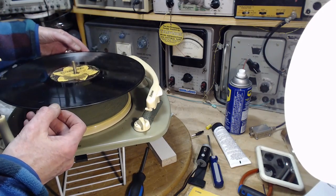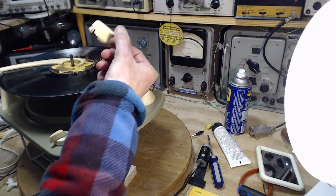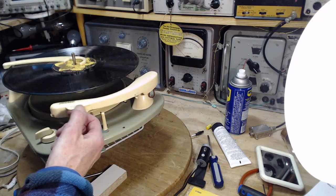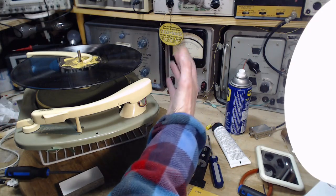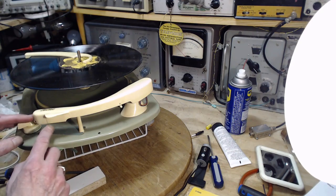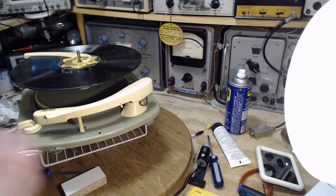The other thing about these record players, there's a class. This is a class of record player. Has a spring-loaded tone arm for weight. Right, there's a spring system in here, right back here. The weight is not adjusted by balance. It's adjusted by a spring. That's a notch down in quality. That's how all these were done back then. Later they came with balanced tone arms, and the reason for that was to lighten this up a lot, so the amount of force here was greatly reduced. They could put very delicate cartridges on them, and the delicate cartridge could produce better and better fidelity as the records got better and better. One of the improvements in the fidelity is the reproduction of the bass.